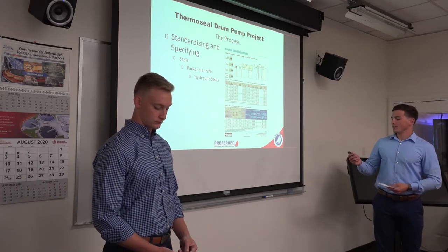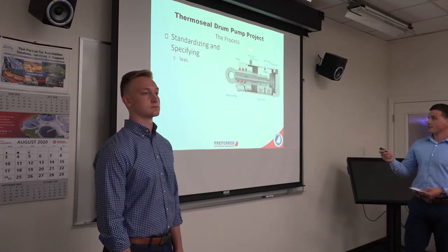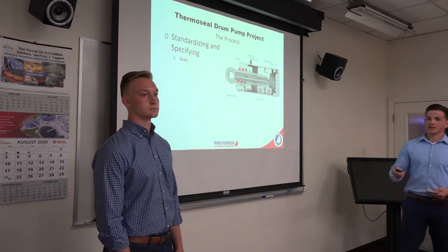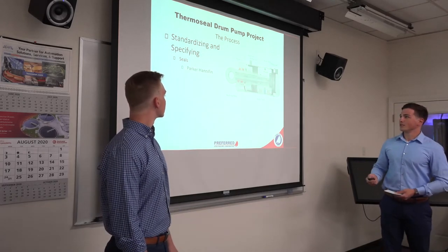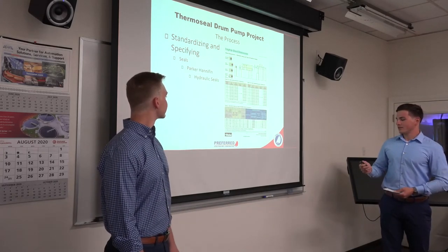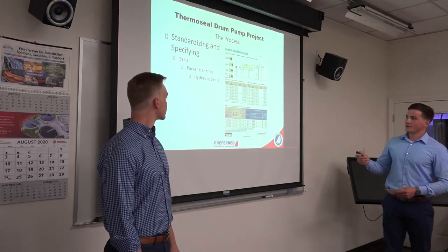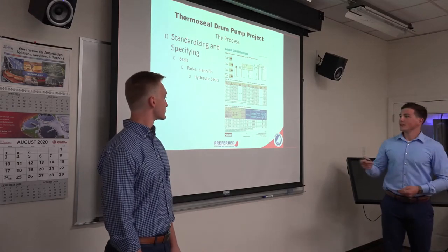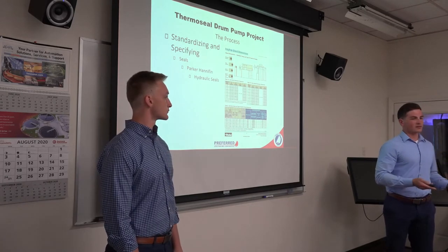What this does is act as this rod seal right here. It prevents hydraulic fluid from leaking from the chamber to the outside world. You take your diameter and select exactly which seal you want, and it gives you tolerances for the different parts, which we include in our drawings.